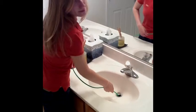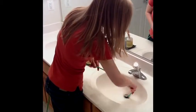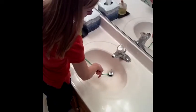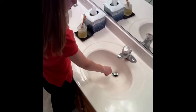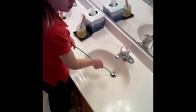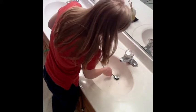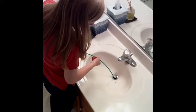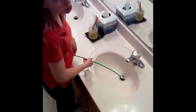Remember, you have to get past that little flap, so you have to move it in and kind of twist it until you get past it. When you pull out the drain jet, you'll see some of the debris that clogs your drain. Insert the end of the Easy Drain Jet into the drain and wait until you hit the bottom. Then pull it back up until you hit the flap. Now we're going to go turn our water back on.